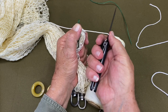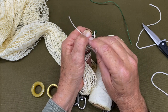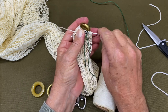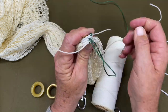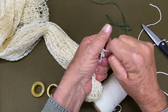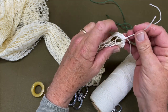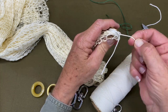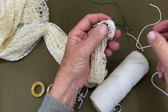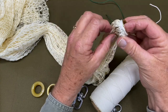It doesn't matter how long I make this extra piece — I can cut it right here, come back, pin it down, and push it through the loop. We're going to pull on this and pull it tight so it's not going to go anywhere. Pull that snug — everything should be in place. We're going to come in here, cut off the original leg and the last wrap. So your thimble is now installed.